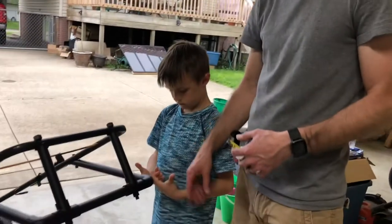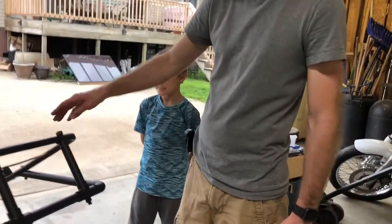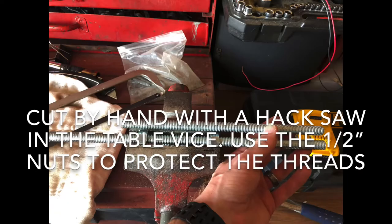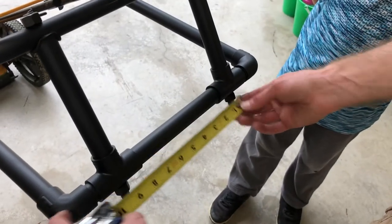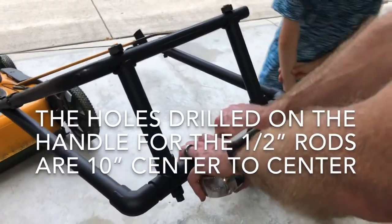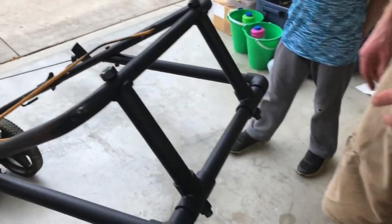None of this is glued together. If you've never used CPVC or anything like that, once you glue it, that stuff is concrete — it's never coming apart. The all-thread rod may cost you a little bit; I found some scraps from the shop where I work. A few bucks for your all-thread rods, which are 10 inches long top to bottom. Keep in mind your cut length is going to be an inch and a half shorter than center to center because your takeouts are three-quarter inch. The middle section was cut somewhere around eight and a quarter to eight and a half for a grownup. It doesn't leave a whole lot of room for your hands, but it works for a kid. So is it the prettiest? Not necessarily, but now that it's got this nice coat of matte black, it's coming together.